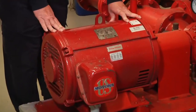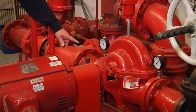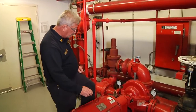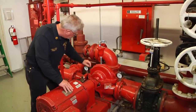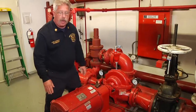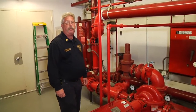First we're going to start with our electric motor and our horizontal shaft fire pump. Here is the main body of our fire pump — this is a centrifugal fire pump. Just like fire pumpers, building fire pumps have some gauges, and just like fire pumpers there will be a suction side gauge and a discharge side gauge. The discharge side gauge is important to the fire service. Should there be a fire in this building, at some point in time a firefighter should enter the fire pump room — first to determine if the fire pump is running.